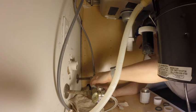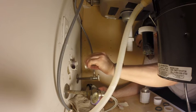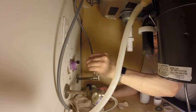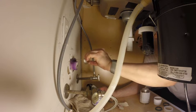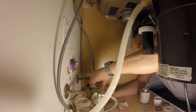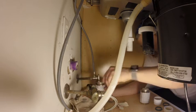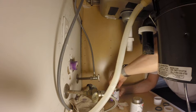So take the primer, the purple stainy stuff, and it's already dripping everywhere, because that's what this stuff does. Apply it liberally all the way around, make sure it is good and stuck, or primed. What this does is actually start to activate the plastic to melt, because it's basically what PVC cement and your basic modeling cement do. Remember when you were a kid and you did models, it doesn't glue like super glue does. What it does is actually melt the plastic a little bit.